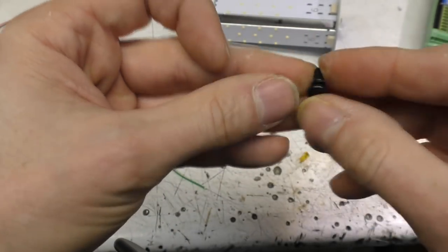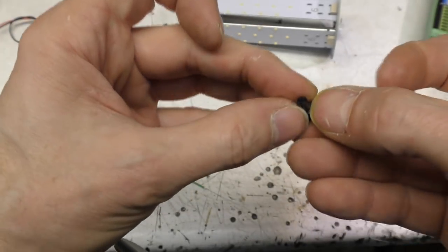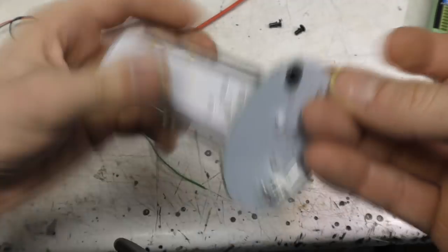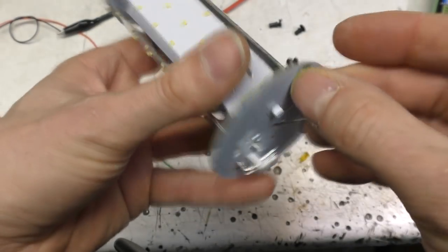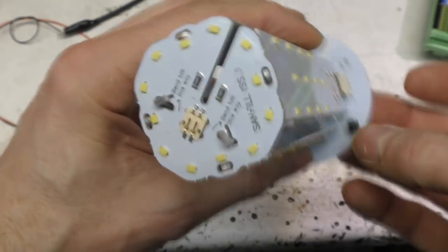They've actually got a lot of advantages. Obviously they're a lot faster to install. They won't ever work loose, and you can insert them from one side, so obviously much quicker to insert than a screw. The other nice thing is because they're plastic, if you're going into a PCB, you don't have to worry about keeping tracks clear of the hole as you would with a metal screw that might make contact with the PCB.